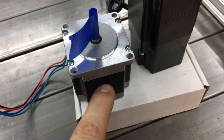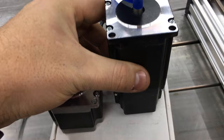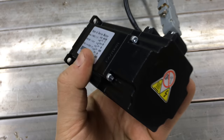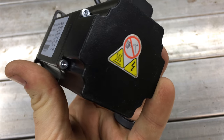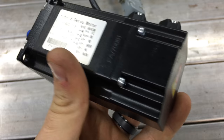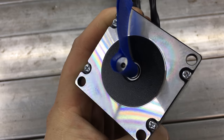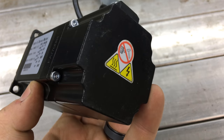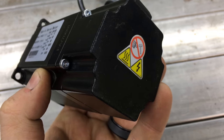But not too high that it overheats the motor — the more power, the more heat. The hybrid stepper will throttle the power levels depending on the work being used. So how does it know to do that? It uses this little guy on the back. It's an encoder disk that rotates with the motor shaft. A couple of sensors read the position of the motor and feed that back to the control board. The control board knows where the position of the motor should be, and this tells it how close the motor is to where it should be, then it does its own corrections in real time.